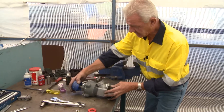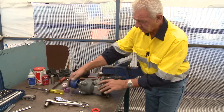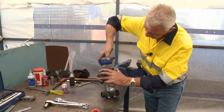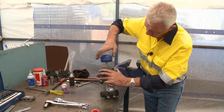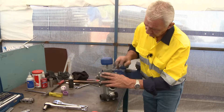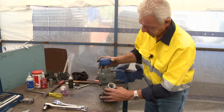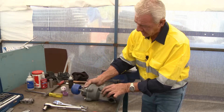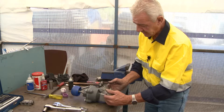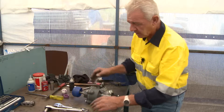Now that the plug's put back in, where do I start disassembling this? We've established those two little plugs are clear and clean. The best way is to wind that big knob all the way counter-clockwise — righty-tighty, lefty-loosey — and take the tension all the way off it. Underneath here is a spring putting tension onto the piston. If I leave that knob wound all the way in when I undo these four bolts, I'm compressing the spring and putting excessive tension on the housing I'm trying to remove. So I've relieved the tension on the spring. Starting at the base exposes the piston, the sleeve, the seats, the seals up in the stem, and then the piston — we'll go from the bottom up, which is the easiest way.